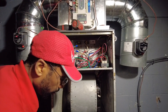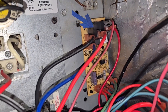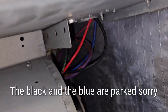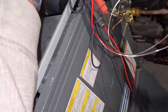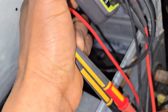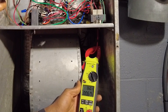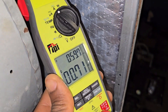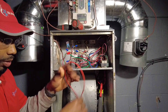Let's open up the air handler door. You can see the blower — the blower fan relay has a red tap coming off the contactor, and the black and green are parked at M1 and M2. I'm going to trace that down and wrap the amp clamp around the red wire. With the meter set to amps AC, we're reading 0.69 to 0.71 amps and frequency is showing 60 hertz.